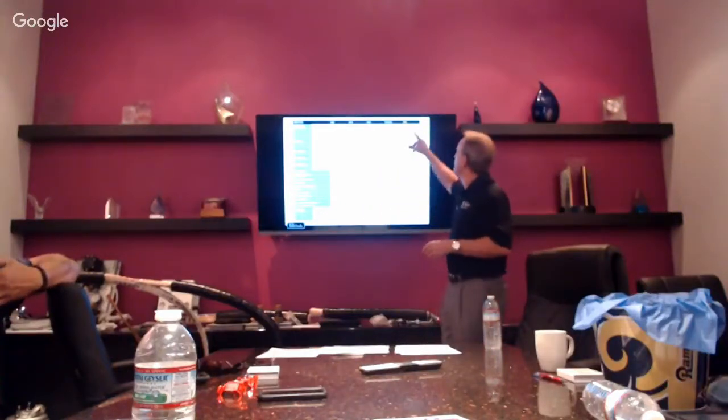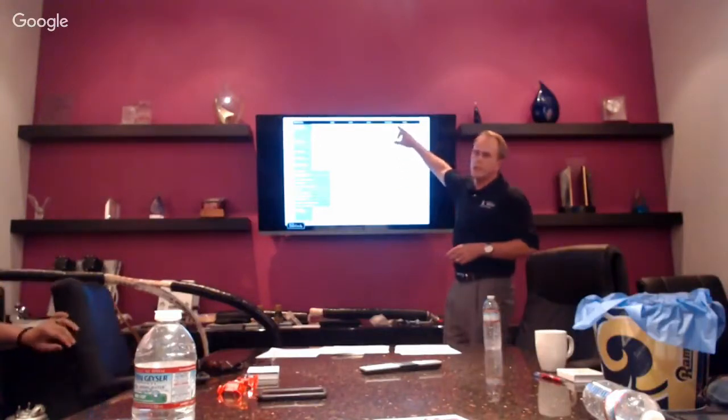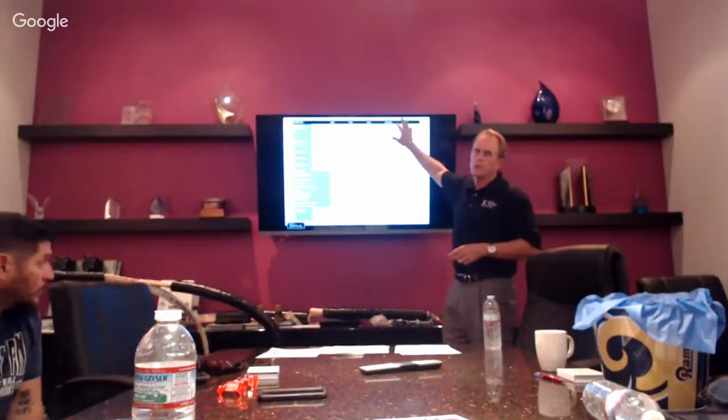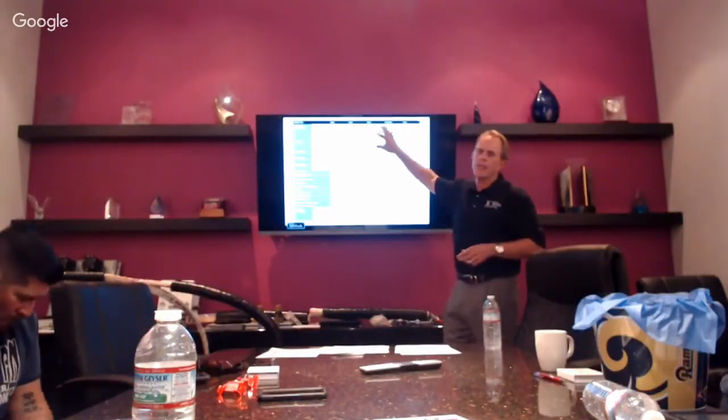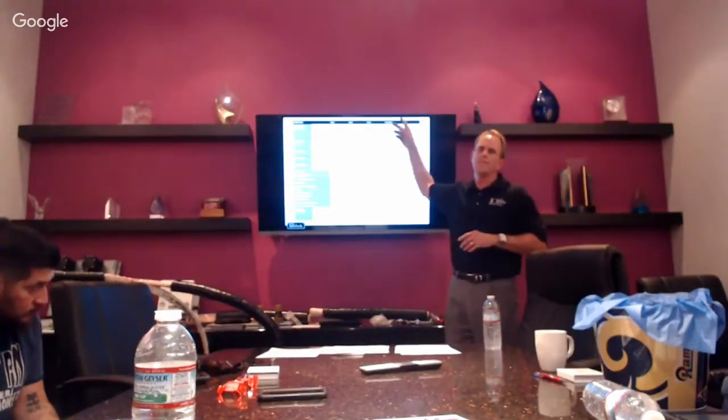The only time you really get iffy is that if we need 3 pumps, the only unit that we can get 3 pumps on is the 4420 and the 4414 230 volt. Those are the only 2 that we can get 3 pumps on. So if it's 3 runs and it's a short distance, I'm still probably going to a 4420-3 or the 4414 230-3.